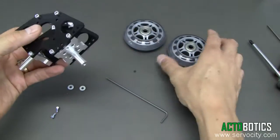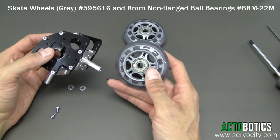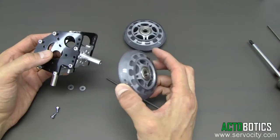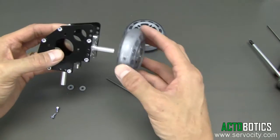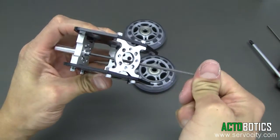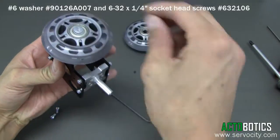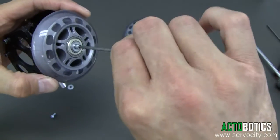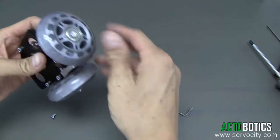So now we're ready to mount our wheels. You've got a variety of wheels you can mount on, but we sell what's basically called a skate wheel with eight millimeter by twenty-two millimeter ball bearings mounted in it — which is a standard ball bearing for skate. You can go to our site and pick these up. They're pretty inexpensive, but just don't forget to purchase the ball bearings for this application. We're going to reach through here first and make sure these are really tight, then slide the wheels on. You want to use a little number six washer on top so the wheels don't come sliding off. Put that one on, cinch it down, then the second one on.